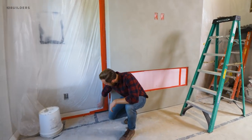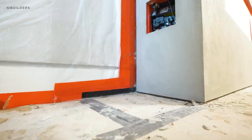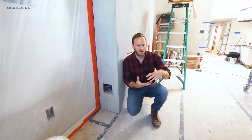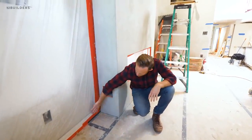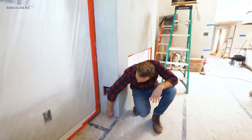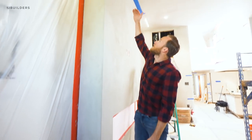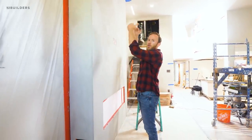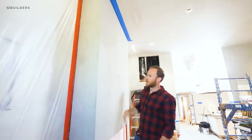Stylistically, behind this plastic we have a four to five inch recessed baseboard with a half-inch reveal between baseboard and wall. We did not want to carry that half inch around the fireplace because this isn't considered a wall - this is designed to look like a cube or extrusion, a different material entirely. So we dyed that baseboard in and separated the concrete cube from the floor by keeping it up off the floor half an inch. At the ceiling we've actually dropped it down slightly more because that is our heat release - as this thing heats up it will pour the excess heat out of the top.